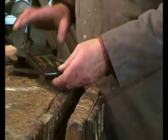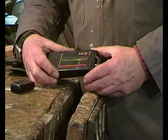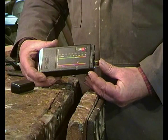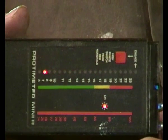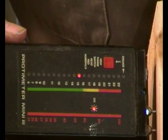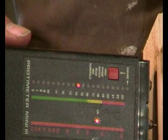You have such things as moisture meters. Here's quite an old one. As soon as you take the cap off it activates it. There are these two probes. When I stick my finger across it you can see the lights move up and down. So I stick my finger across the probes and there it's moving up the scale. I'm going to poke the probes into a bit of joinery timber. And there we go — fifteen percent. That's pretty good for joinery, not bad for window frames and maybe doors.